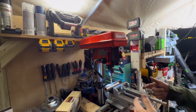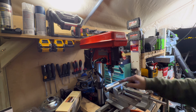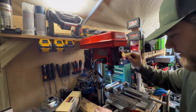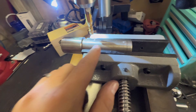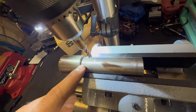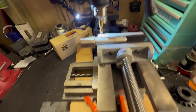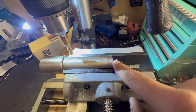Eighty-five dollar drill press. I forgot how much this slide vise was. The end mill set was the most expensive thing — like $80-something dollars as well. Lucky for me, this actually already had lines on it. I didn't need to make a line or anything; this was already there left from the motor. So I'm just going to follow that line right there. That looks like a pretty straight line — it's almost cut in half exactly on this shaft. I need to make sure the line is in the center of the end mill all the way down.